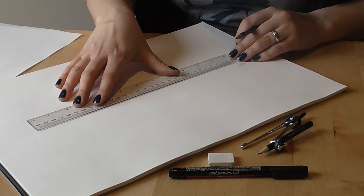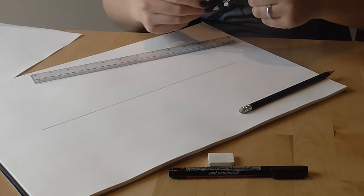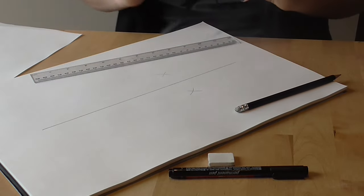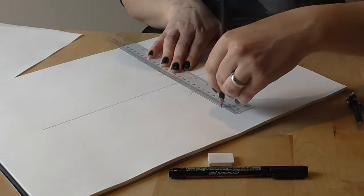The first thing I need to do is draw a straight line down the middle of the page, like this. The next thing I need is a horizontal line at right angles to my vertical line. To do this I use my pair of compasses. I put my compass point on the line somewhere, set the width to something, and make a little mark on either side of the line. I then move the point further down and draw another pair of arcs which cross those first pair — they will be on a line at right angles to the vertical. I can draw that line in now, and as long as my line passes through those two points, that's perfect. Now I've got this nice right angle here.